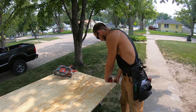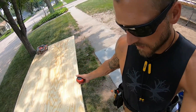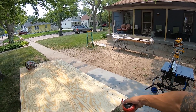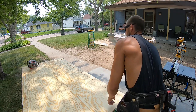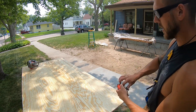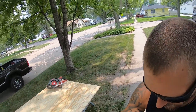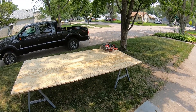That way it's just kind of a good trick an old carpenter showed me. You drop your string line right in your saw kerf and that way you don't need a clamp — it's not going to move on you, and it's a lot more precise than trying to clamp your string line or set a nail.